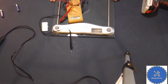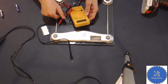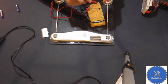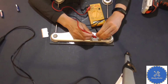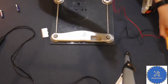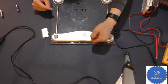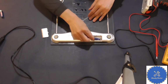And here is a multimeter that I have. You go to ohms. Okay, go to 2000 ohms, which is pretty high, but that's okay for this purpose. So make sure it can go to 0. And now you want to put the 2 terminals onto each side, and you see it go to something like 2 ohms or even 1. So you know these 2 are connected with each other. That means the voltage across this negative and that positive is going to be 3 volts when the batteries are in, and we can again confirm that if we want.